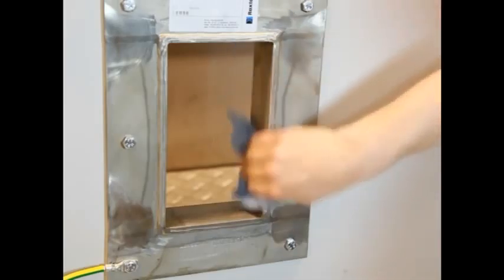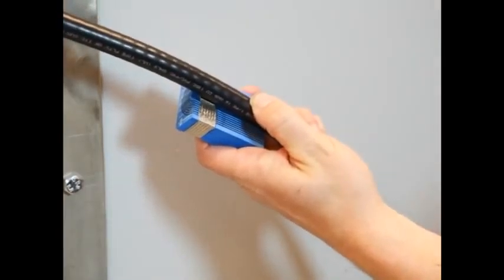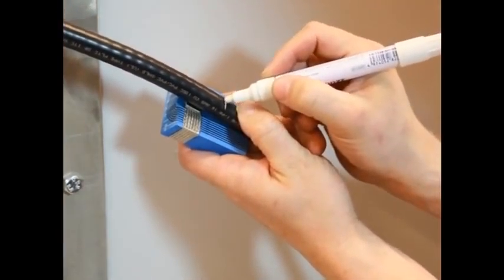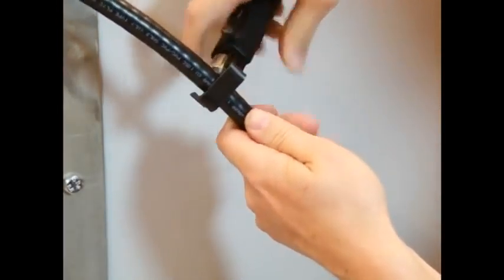Use eye protection when preparing the cables. If you use metal clad or tech cable, mark on the cable where the outer sheath is to be removed. Then remove the outer sheath, as well as any protection tape or plastics.